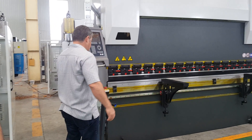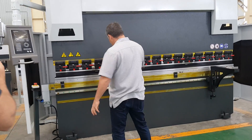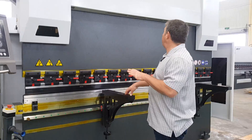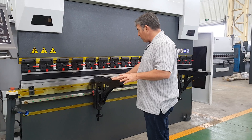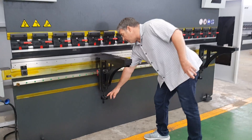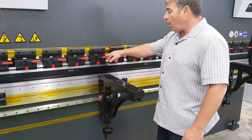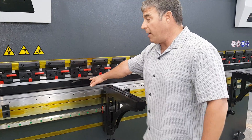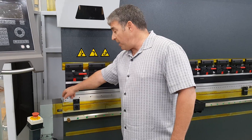As we're walking around with the teams, we have a rapid-up support arm. This is a lighter machine — 148-ton — so we've got a sheet support arm here right now that won't mar the material. Rapid adjustment on the bottom for the height up and down and in and out as well. All the brakes come standard with quick clamps, sectionalized upper tooling, and each side has a horn, which is really nice for box bending so you can get into the corners.